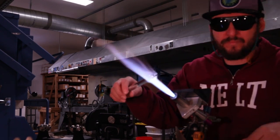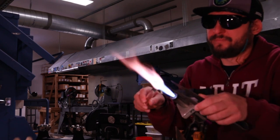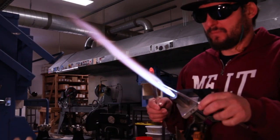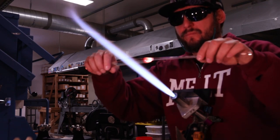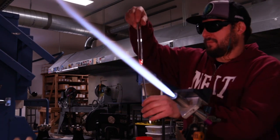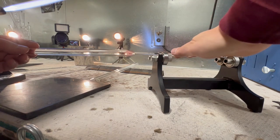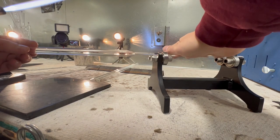Here I'm going to begin with some 16mm solid rod. I'm just going to clean up this end first using the tweezers to get the junk off from the last time I used it. Then I'm going to touch it up with a little pick and roll here, just make sure it's got a real nice taper and it's ready to do a seal. Now I'm cleaning up some 6mm that's going to be the handle. I've attached them and now I'm going to take it to the roller after I let it set up in my hands for a little bit. The object here is to get it straight where it's glowing hot and then straighten where my left hand would be once that spot starts to set up.